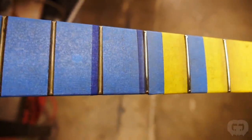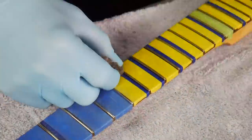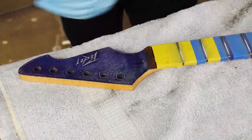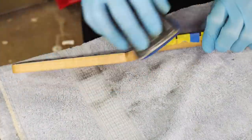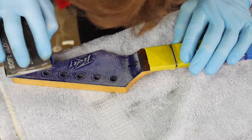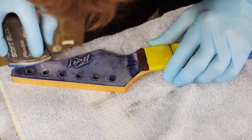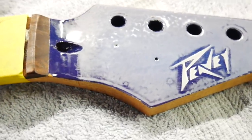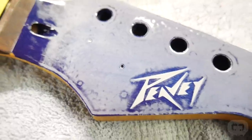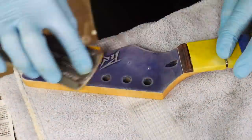Although the headstock looked pretty shiny, it had some minor imperfections — a couple bumps and a little uneven texture. So I'm going to level sand it starting with 800-grit sandpaper, then move to 1000, then 1500, and finally 2000 grit. For people brand new to painting, their first clear coat looks so good they wouldn't want to sand it down. But the trick to getting a mirror finish is to sand it all level and then polish it up from there. I've sanded most of the headstock but there are still low spots — the darker areas haven't been sanded yet — so I'll carefully continue until it's all level. You need to lay down a thick clear coat so you have enough material to work with and don't sand through into your color.